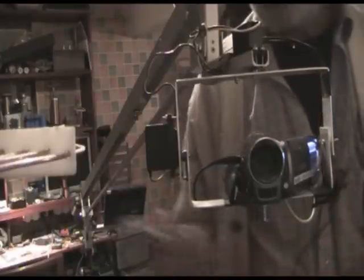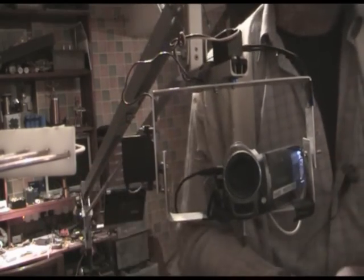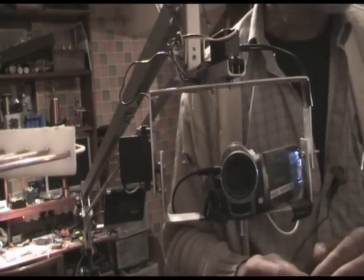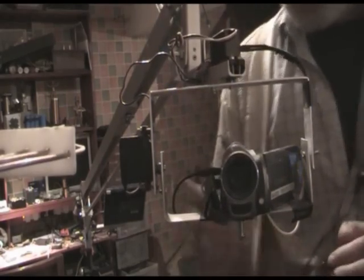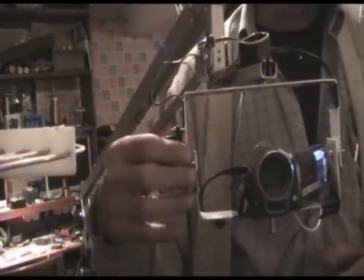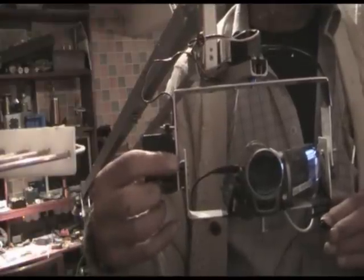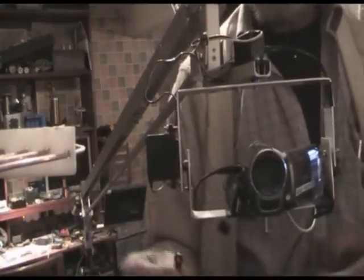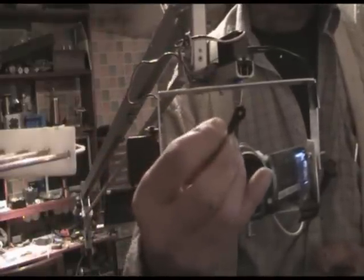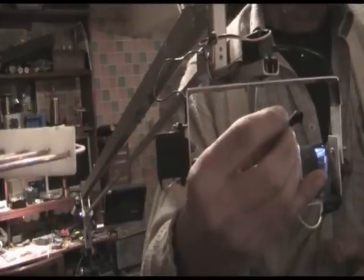As you can see, I've got one servo on the side and one servo on the top. The top one is for pan and the bottom one for tilt. There's no zoom control on this system apart from manually on the camera. To mount the servos, it's basically just a frame of aluminium strip, with enough room inside for a coupling. The coupling itself is one of the horns — I've gone for metal horns rather than the plastic one supplied with the kit.